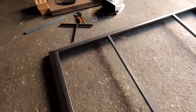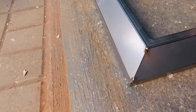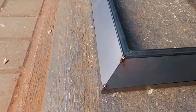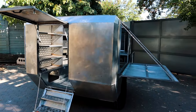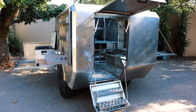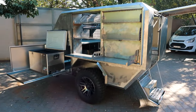Now we have the base of the roof spot welded together. I will use the frame to attach all the hinging hardware, gas shocks and handles for lifting the roof, then I will cover the opening with a lightweight sheet of fiberglass just to keep the elements out. Fiberglass will have much better insulation properties than steel or aluminium when we're out in the elements. Now you should have a better understanding of how I built the rest of the camper — all the doors and angles you see on it were bent to shape using this method.